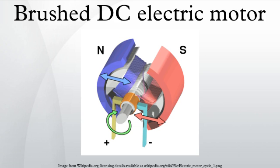Protection. To extend a DC motor's service life, protective devices and motor controllers are used to protect it from mechanical damage, excessive moisture, high dielectric stress and high temperature or thermal overloading. These protective devices sense motor fault conditions and either enunciate an alarm to notify the operator or automatically de-energize the motor when a faulty condition occurs.